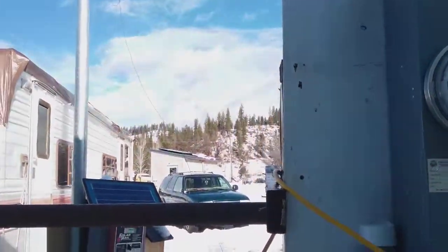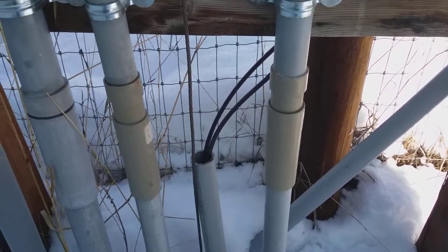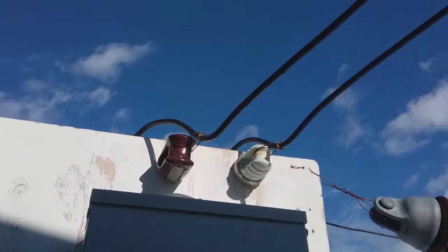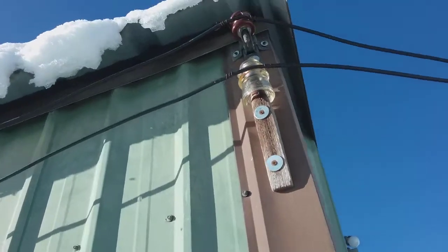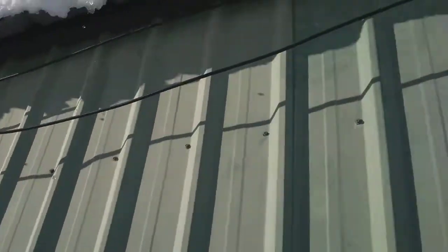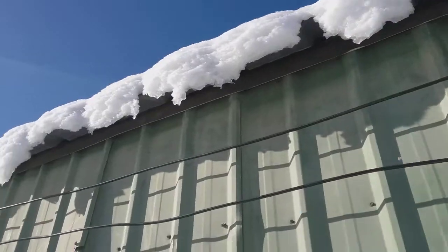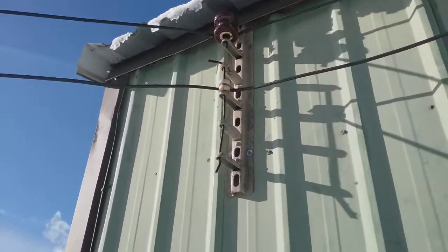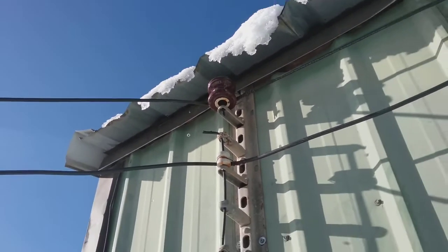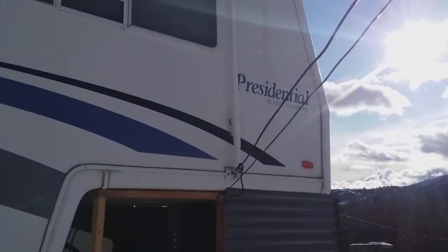So I'm over here at the meter box. There's the office. The conduit comes up right here — I don't have anything on it to keep water out yet. Two wires, positive and negative, go up to these two lag bolt insulators I just had around, then up this way over here. I have a spool insulator and also a pin insulator there. Then this just comes over here, just behind the drip line, over to this rack that I actually got at the dump. This rack has two spool insulators — bottom one's negative, top one's positive — and that comes over and connects in right here.